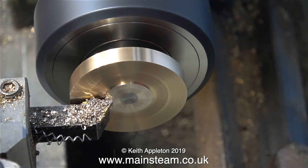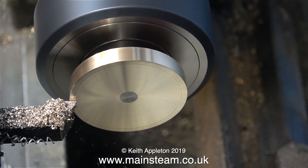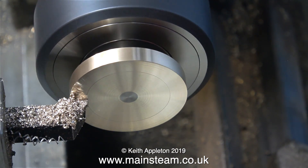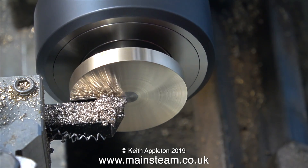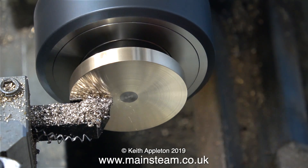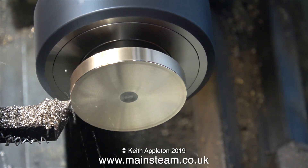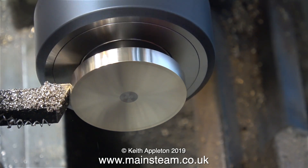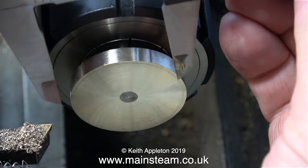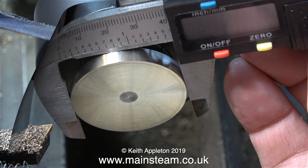Because the diameter of the part of the shaft that goes into the crank web is only a quarter of an inch, I'm taking very fine cuts and the last cut is finer than the rest so I get a good finish on the work. Here's a good tip: once you've turned the part down to the center like this, bring the tool back the other way without altering the setting and that way you get an even better finish. Here I'm turning down the outside diameter - testing the size with my digital caliper confirms that this is the same size as the original crank web.